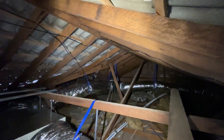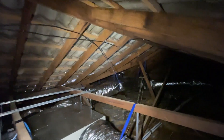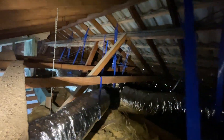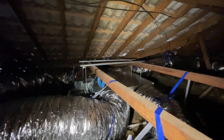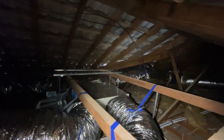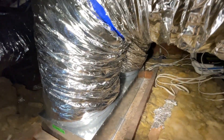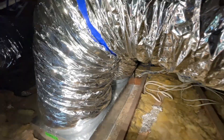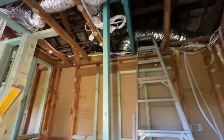There's the same thing, an exact air regulator, and the ducts go up. I'll pull the duct as tight as I possibly can — the shortest duct run possible, all strapped up. I really want the return air to have no restrictions, and I want the return air box and the supply box all silver taped, sealed, and the return air filter media changed over to electrostatic.